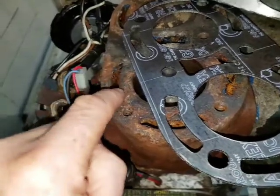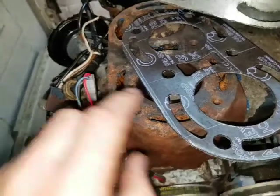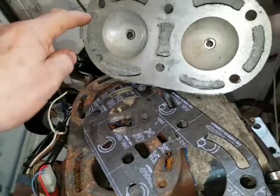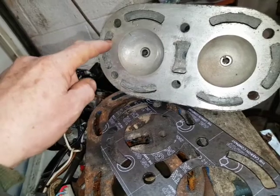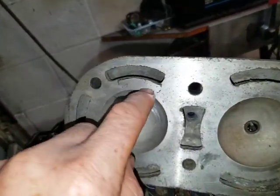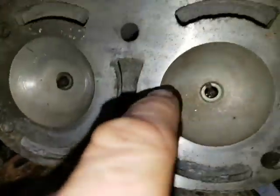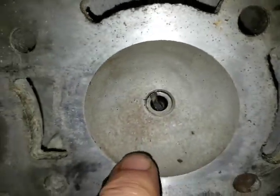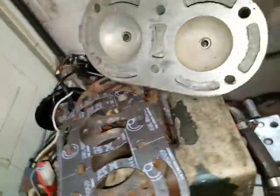And you've got salt water here, not normal car water, which is antifreeze water. So this is corroding through. Because of the dissimilar metals, it sets up a micro voltage between the two constantly, and you get electrolysis. This has been repaired, but the owner wasn't happy after it was done. It's going to fail again and again. But even where it's not failed, you can see the pitting starting microscopically. And that's due to the fact that the gasket is always going to be slightly porous after some use.